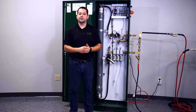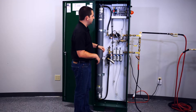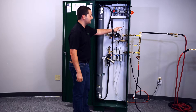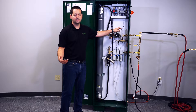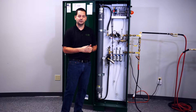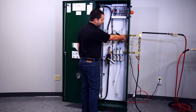The next step is to test the production of the nitrogen generator. In order to do this, we need to open up the ball valve behind the flow meter in the generator. We get a lot of questions about this device — it shows you what your nitrogen flow is. It's very important that these nitrogen generators produce enough nitrogen to spec so that they are sized properly. Open the ball valve behind the flow meter and your nitrogen will start to come out.